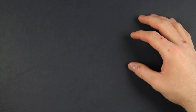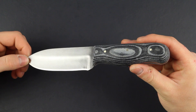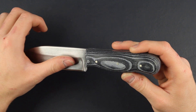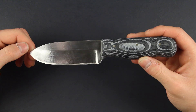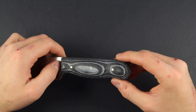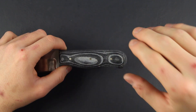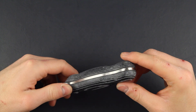After those two knives I decided to try and make my own knife from scratch. I bought a bar of 1095 steel and made this one here. I free-handed the design onto the steel — no measurements, just drew it on and started cutting away, trying to put a hollow grind on it. You can see how inconsistent it is; I was using a small bench grinder. I made the handle scales out of homemade micarta — I took a black t-shirt, layered it with denim, alternating between the two, pressed it with fiberglass resin, then cut and sanded it like wood.